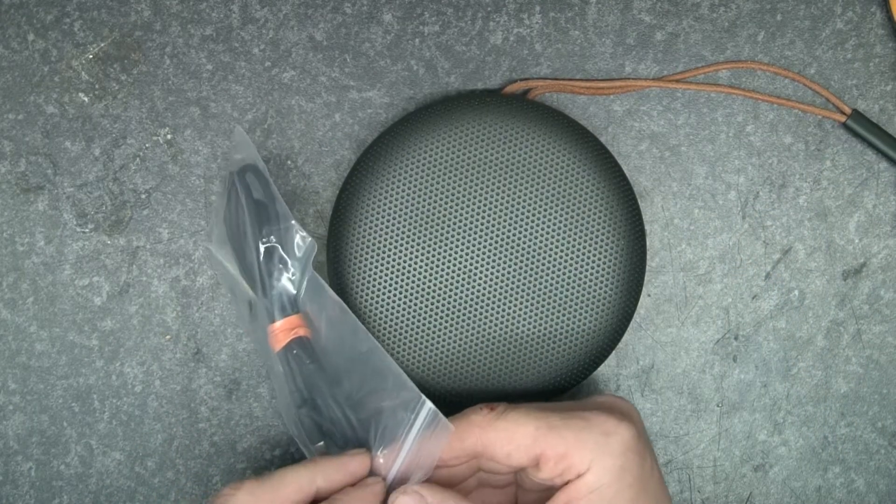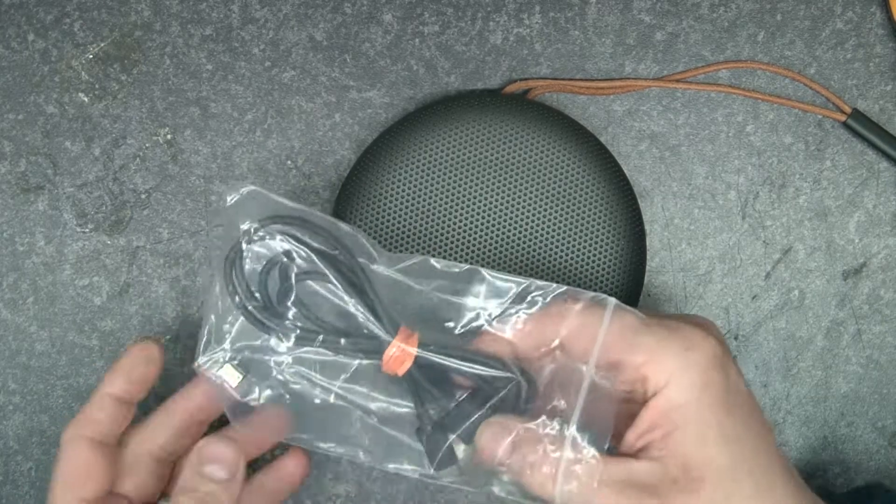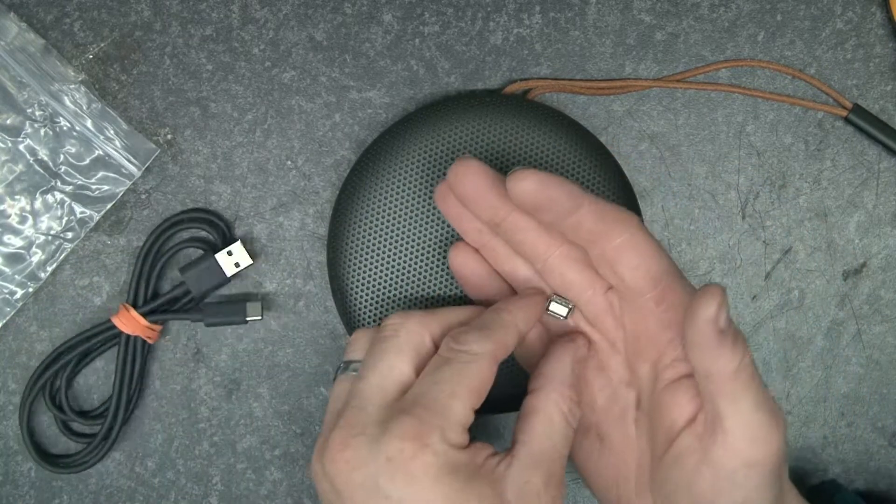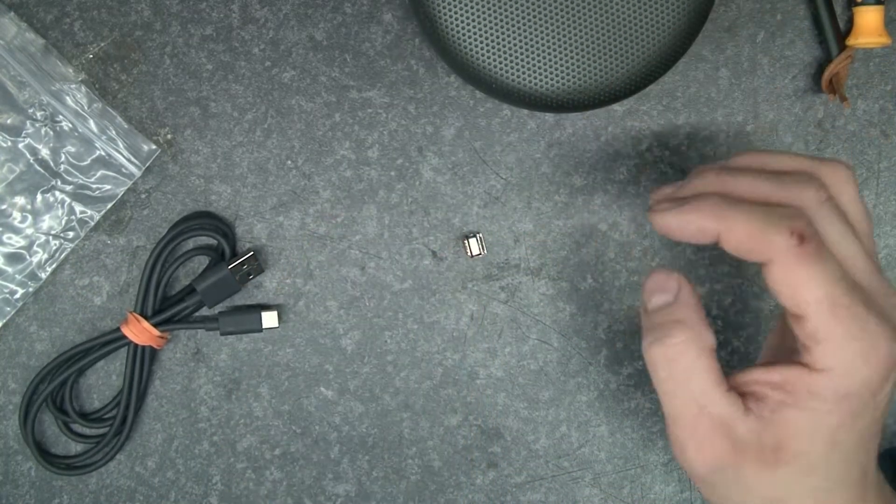The power lead here, which is USB 3, and in here is the power jack. I will just reposition so as you can see there is the power jack. It's got some proper tiny little terminals on here and it's broken off here and here. What we're actually going to do is we're not going to put this jack back on — we're going to put another socket or cable soldered into it to allow it to be charged.